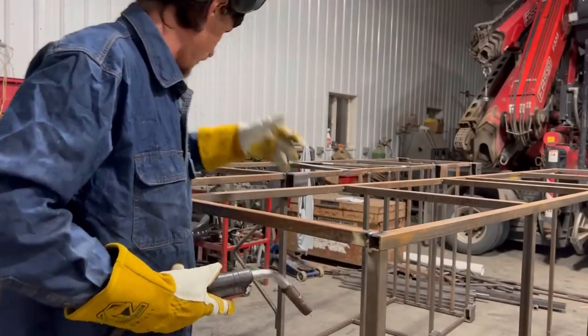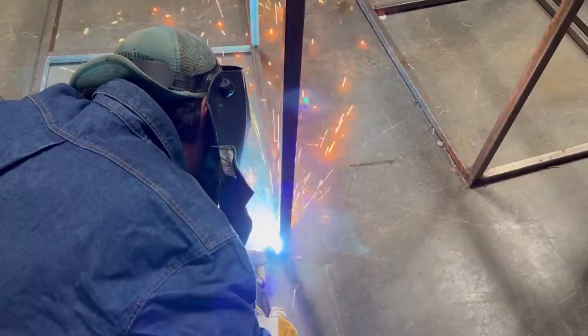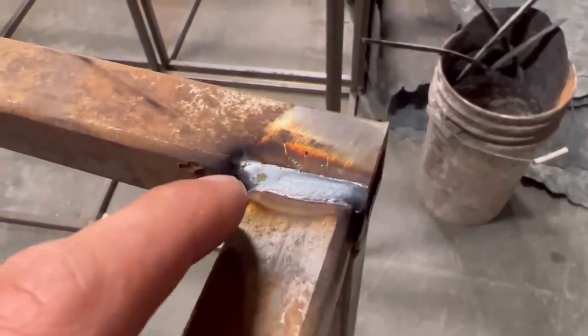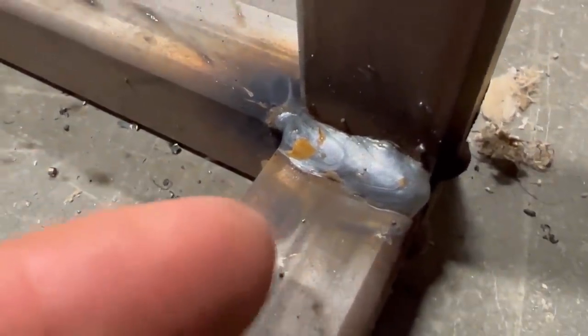So there's our first one with no tack in center. There's a tack right there in the middle of the weld. I'm going to go ahead and run over it and show you the result versus no tack. Here's our weld with no tack — you can see it's got a nice, even, uniform layout. I was a little quick at the end; I should have let it fill that crater in a little bit more. But it's really not bad — it's not undercut. It's a good weld. Where the tack was, it's raised. There's probably a little bit of porosity in that weld. I'll grind that out later and clean it up. But you can see the difference, especially when you look down the weld — see how raised it is in that one area? That's where the tack was.